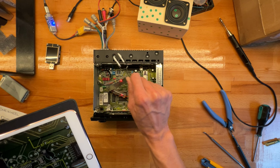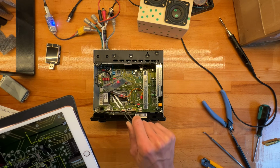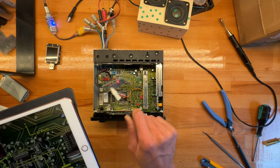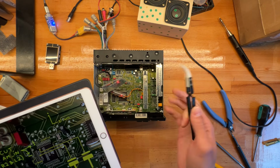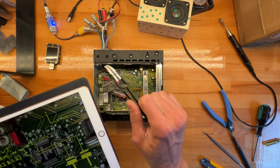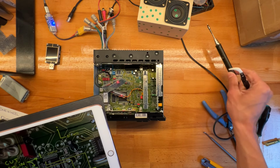This area definitely goes above 100. This is a bit cooler here, but you can expect it to hit 60, 70, at which point hot melt glue is basically tap water. So do not do that. Sanitary silicone is super good, stable up to and above soldering temperatures, right?